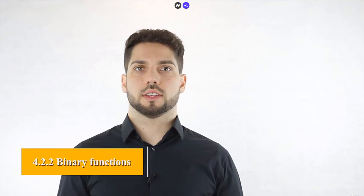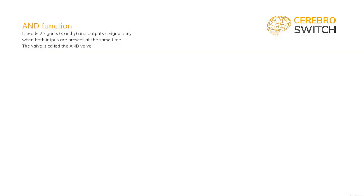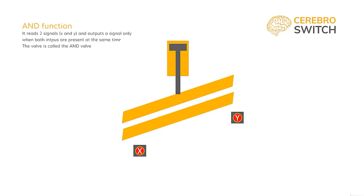In the futuristic industrial environment we can see coming in fast, automated control of processes is going to be more and more easy to manage by less and less specialized people. But there are also simpler processes which can be designed very fast at a very low cost directly with binary pneumatic logic. These are a series of valves which embody binary functions found in electric command, low-level program development, and ICs.